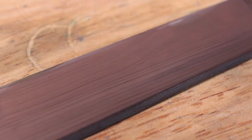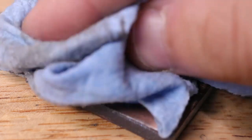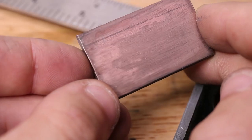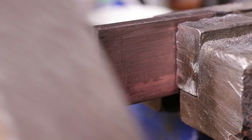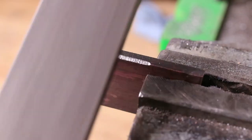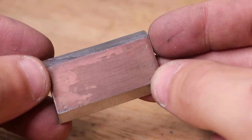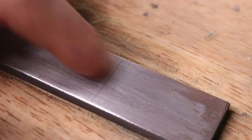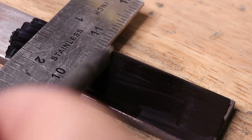And as you can see, the vinegar has had a big impact on the solution. It reacts more readily with the iron and the coating is much more even, and most importantly, it's much tougher than before. The part can now be marked up for machining. The copper is unaffected by any solvents, so to remove it, we need to use scotch-brite or abrasive paper. The only real downside to this method is that scribing does leave a fine mark, something that does not occur when you use layout dye or markers.